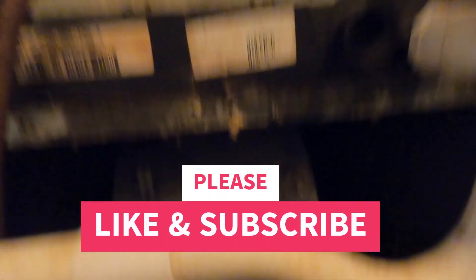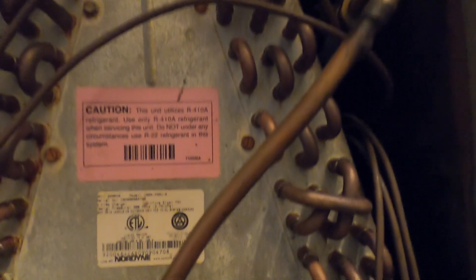Alright guys, I was running this unit and there you go - a 14-year-old coil with copper, still original, still holding charge, no leaks. Go figure. Anyway, this thing's running a little bit of a high head pressure in heating mode, and this blower wheel back here is caked up pretty good. So we're going to pull that out and clean it, and the evaporator coil as well. The capacitor on this blower motor is good, the filters are in good condition, so we're going to pull this thing out and get this blower wheel cleaned up.